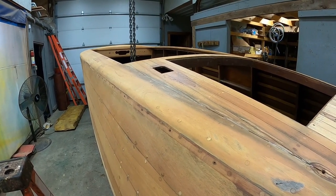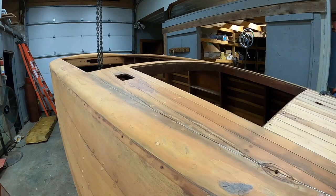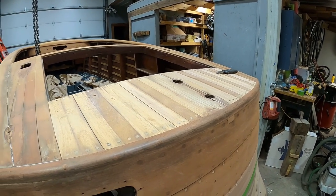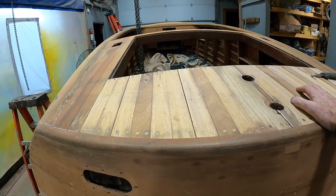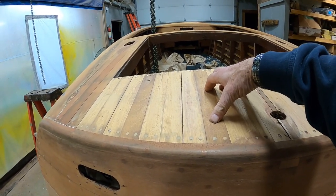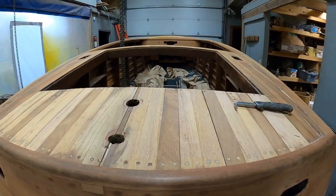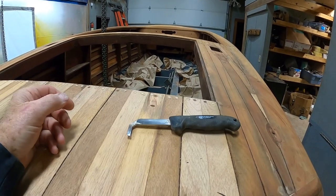She's pretty original in terms of her deck planking and her covering boards. This aft deck, as you can see by the difference in color, has been completely replaced. All of this is new, and unfortunately, whoever replaced it inserted individual planks and didn't bother to open up Sikaflex seams, which we are now in the process of doing. Our tool for this purpose is a reefing hook.